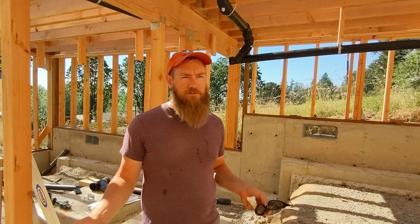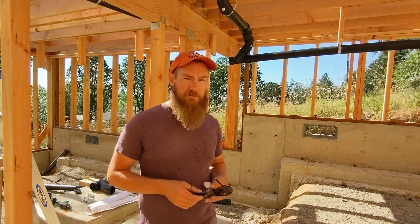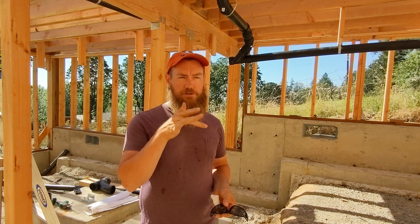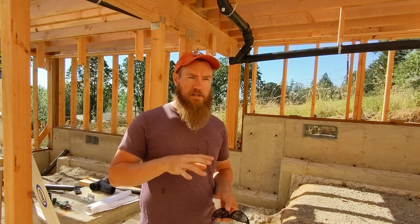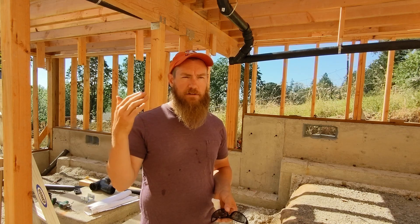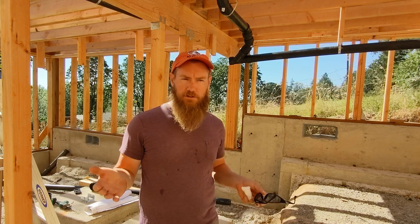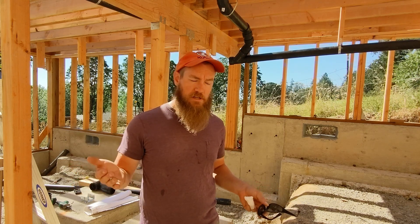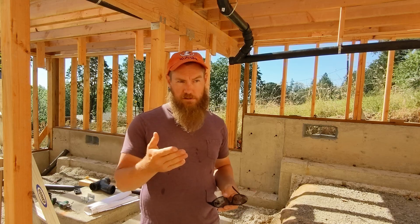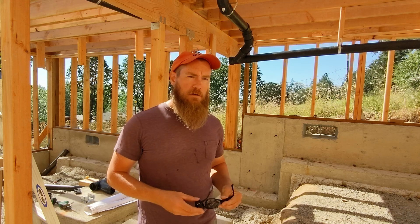That part of it, they really don't necessarily charge all that much for labor. And a lot of the companies are like, 'Sweet, I don't have to install the ducts.' So I'm going to get the ducts done. We did choose some non-typical sizes — instead of four, six, eight, we bought a bunch of fives and sevens. Being a more specialized size gives you exactly the supply you need to service a room, but it may also mean, as in our case, that you're a little short and can't pick up all your parts at once at a big box store.